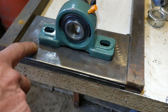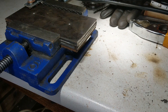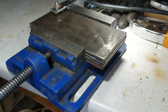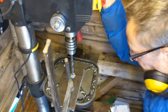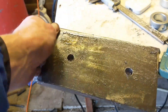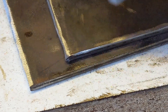I need to drill through these three plates — I'm going to do them all in one go. I'll tack weld them together so they don't move, then drill them all in one go. That's the first hole drilled through all three plates. Done — all exactly the same. Now I just have to grind off the welds and they'll separate. The edges are very nicely cleaned up for welding to the frame on either side.